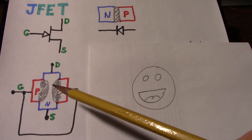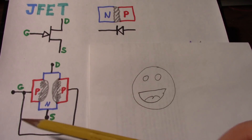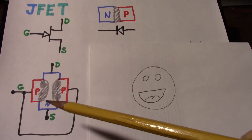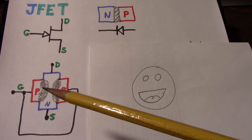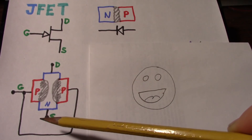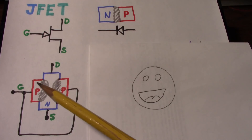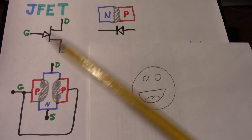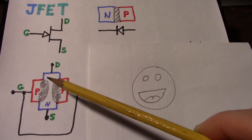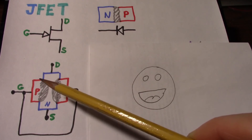Down here I have a diagram of a JFET. This is not necessarily how it really looks — it's meant for describing how it operates. Just like NPN and PNP transistors, you can have N-channel JFETs or P-channel JFETs. Here is what's known as an N-channel JFET. You have your drain and source, which connect to the ends of the N-type silicon. On the sides, we have P-type silicon connected to the gate. Just like in our diode, where the P- and N-type materials are joined together, it forms a depletion region. As you change the voltage on the gate, you can make that depletion region get larger or smaller.